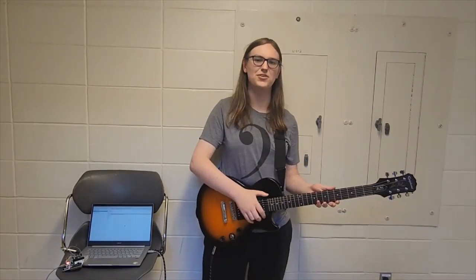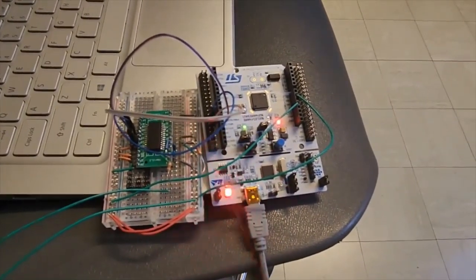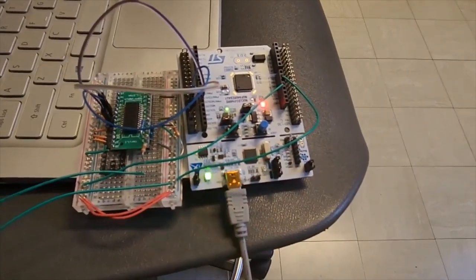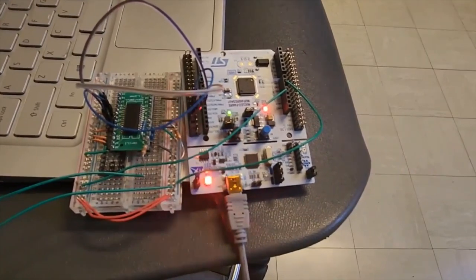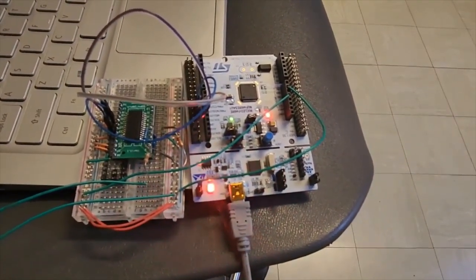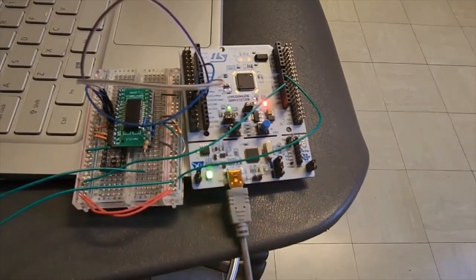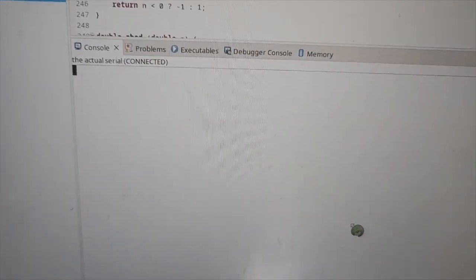Hi, I'm Avalid from the MIDI pedal project, and I'm responsible for the MIDI conversion subsystem. The subsystem takes the guitar output and turns it into a MIDI signal that a computer can use for recording or playback as a different instrument. It consists of an output jack wired into a high-performance ADC, connected to a microcontroller that runs the pitch detection algorithm called the Yin Pitch Tracker — designed to be high-performance and as accurate as possible, which is important on an embedded platform where performance is more limited than on a PC.